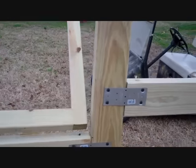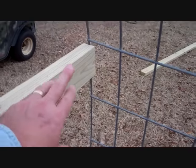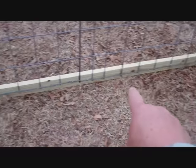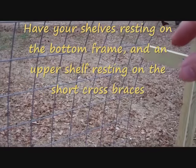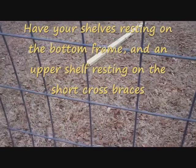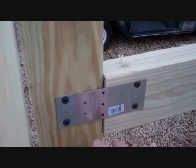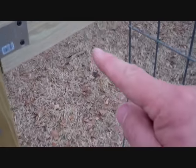One of the reasons I did put the corner braces on and would recommend them is you're going to want to put a couple of two-by-fours spanning the length of it for shelves — a shelf all the way across here, two two-by-fours wide, and two two-by-fours up here all the way across. That just helps this structure if you load it up with a lot of plants. Once you water them and they get pretty heavy, the brace will certainly be nice to have. You could always put a two-by-four between there and there, and that will give it plenty of support.